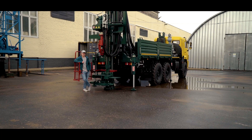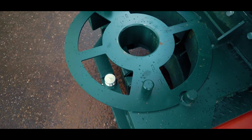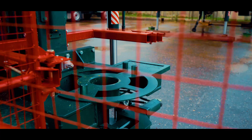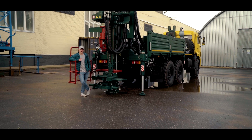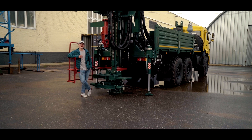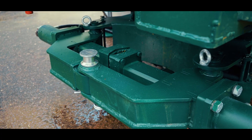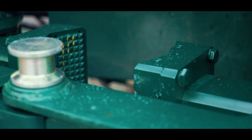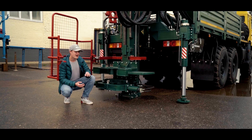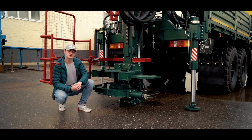The drill holding table is intended for work with drill pipes — for holding, screwing, and unscrewing — and also holds the casing. The maximum diameter of casing is 425 mm and the maximum pass-through diameter is 490 mm. The pipe holder is intended for work with drill pipes with a diameter of up to 85 mm, and the maximum pass-through diameter is also 490 mm.